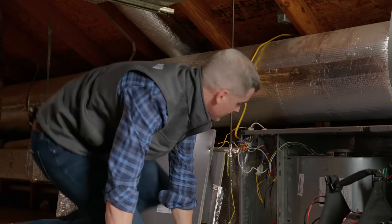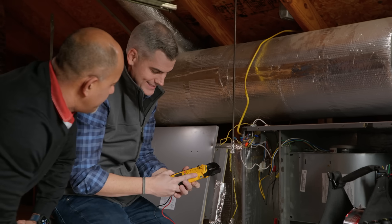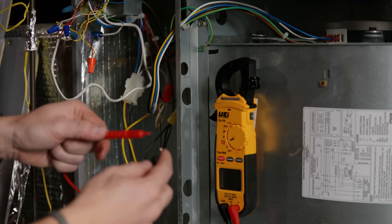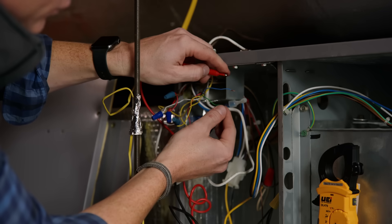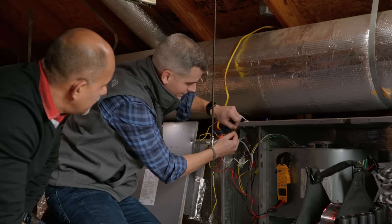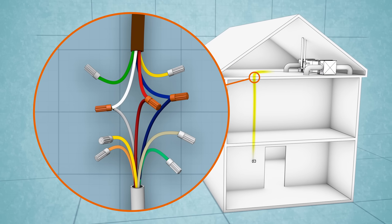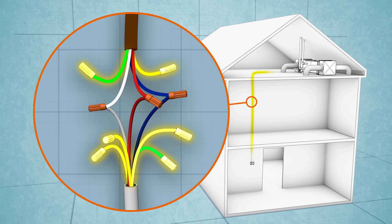So I bundled the wires together downstairs, and now we're going to check for continuity. I take out my multimeter, set that to continuity, and you can see that it's an open loop. That means it's open, and I should get a beep when I touch them together. So now when I go with my probes across the green wire and the blue wire, I should get that beep. But it seems when they made the splice, they probably didn't connect the wires to the spare wires.